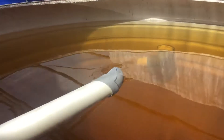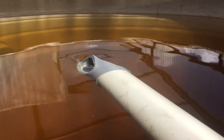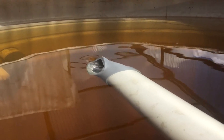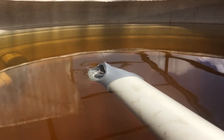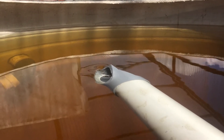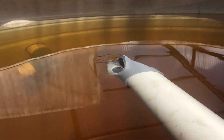My goal is to get the solids to drop down to the middle of the tank. They are kind of catching on the sides a little bit, but that's okay. This right here is the output — the solids fall and then the clean water leaves through the top, and that's an elbow cut down. I turned it sideways; it seems to work a little bit better sideways. If it's flat it's catching air and bubbling and slowing down the flow, so I've got it where I like it.